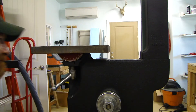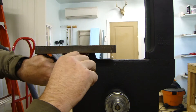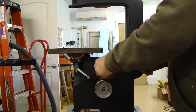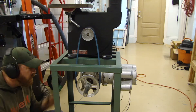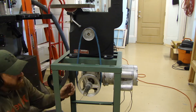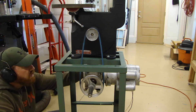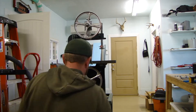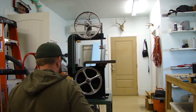So here just putting on the table. That handle you just lift up into the other piece that's on there, and then you can tighten and loosen — so that's intentionally loose. And then putting the belt back on, and then I'm going to adjust it. You only see me doing this for a couple seconds here, but it probably took me a few minutes to get this thing adjusted right. Then I tried cutting a little bit of steel and it was still loose, so I adjusted again. The whole thing probably took me seven or ten minutes.